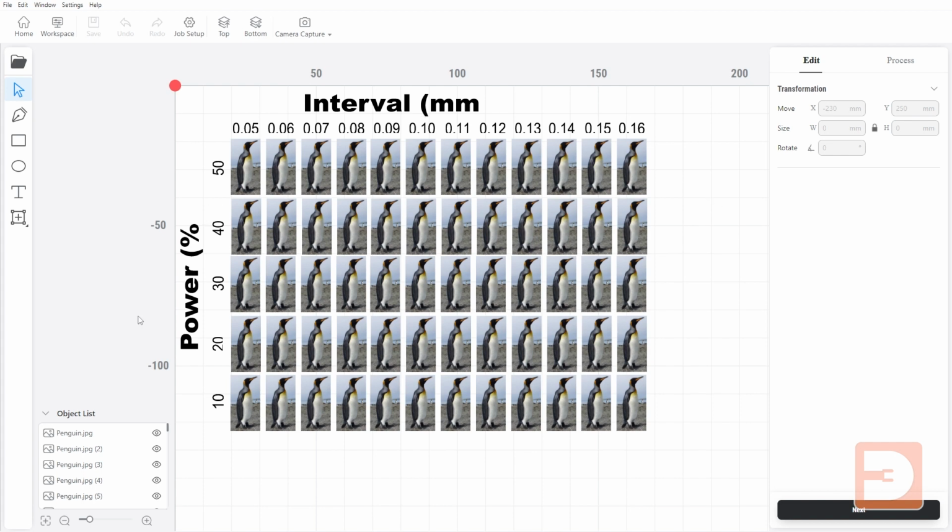One thing I'll quickly mention is all the grids that I've uploaded here, both as the project file and as G-code, are all weighted in the top left. So when you are selecting the position to engrave on your engraver, the top left is the origin point of all of these files. Obviously, if you open the project file, you can change that for yourself if you would rather something else, but the top left is the origin point for all of these projects.